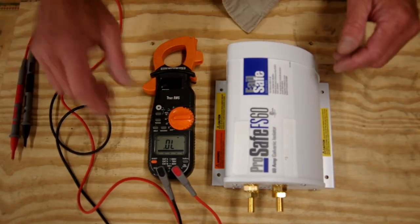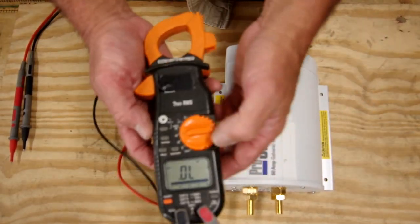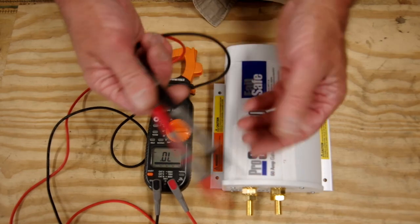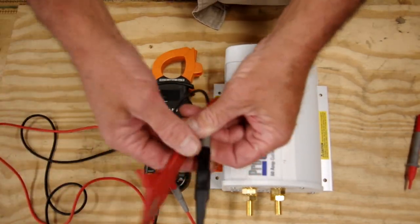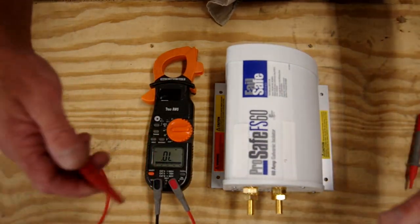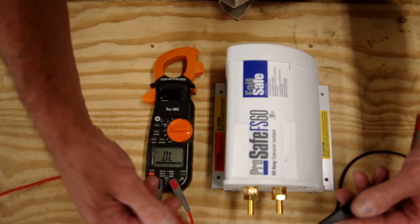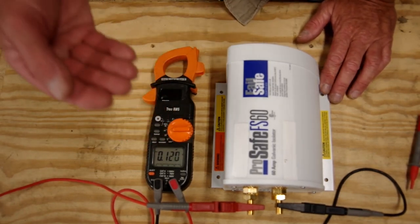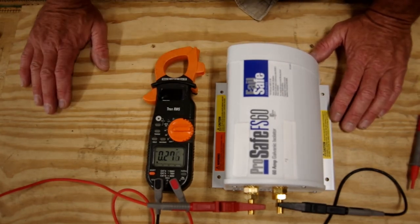To test one of these devices, you need a multimeter with a diode test feature — I've selected diode test here and have the diode symbol on my screen. We just measure across the terminals. I'll connect my clamps each to one post. What you'll see on the meter is the voltage increasing. That voltage should increase to a point where it stabilizes — usually about 0.8 to about 1 volt — and then it will stabilize. We'll wait for that.